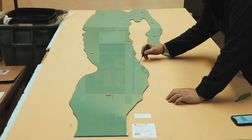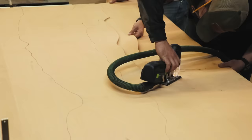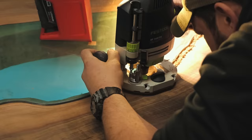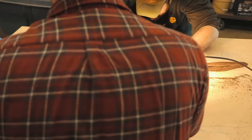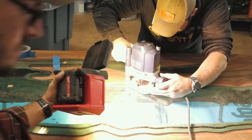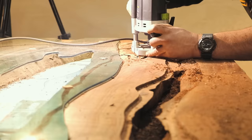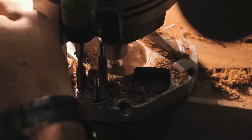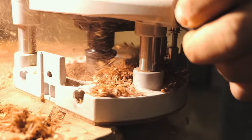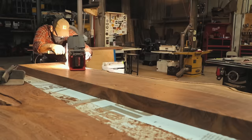Now that I have the actual glass, I use it to create an outline stencil to get the perfect fit for the router. I'll use a quarter inch templating bit around the edge of the glass itself in order to cut the grooves. I only use this stencil for the fingered part because I cannot use the edge in that situation. I use the void in the template in order to create the area that the finger will sit into. Note that I would highly suggest, if using tempered glass, to be very, very careful if you're going to use the glass as your router template. This technique can and will scratch the glass — I had to learn this one the hard way and eat a solid chunk of my profits by having to take the glass back to the glass company in order for them to fix it.